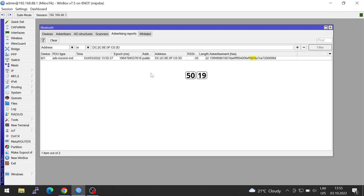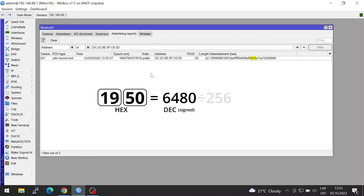This might sound alien, but please do not worry — RouterOS or the server will do all of that for you. RouterOS scripting allows you to structure the data in hexadecimal format so that the server decodes it, or RouterOS can calculate a decimal value using additional scripting lines. We do not advise doing that as it will load the device more. As a quick example when dealing with a positive temperature: if you see the temperature in the 14th and 15th octets as 5019, you'll need to switch the octets' places and divide the hexadecimal value by 256, and that results in a temperature of 25.31 degrees Celsius.